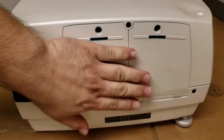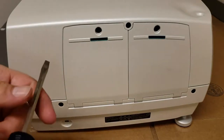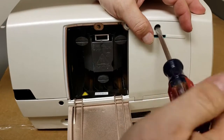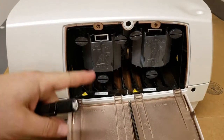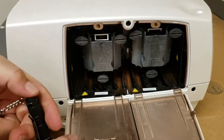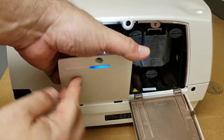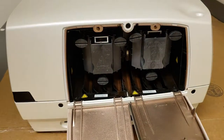This particular model uses two lamps. They each have their own lamp access door. You can use a Phillips head there if you only have one, but you'll see why we're going to use a flathead in a moment. Just turn it until the screws are loose and then the door will flip right open. We'll open lamp door two as well. One neat design element of this which I really like is they utilize the light from the lamp to tell you which lamp is on. You can run this in single lamp or dual lamp mode. When the lamp is lit, it lights up that little light pipe here. You'd see this lit up when lamp one is running, and if lamp two wasn't running, it would look dark. When they're both running, you'll see them both lit up. It's a little feature, but it's a neat feature.